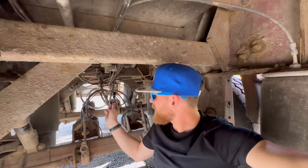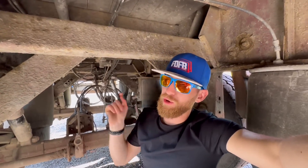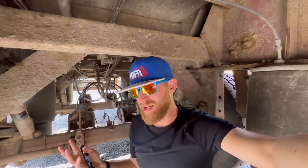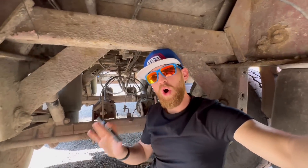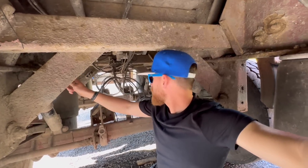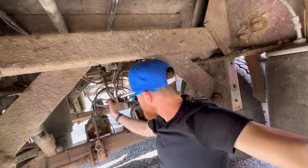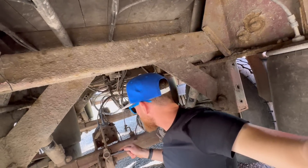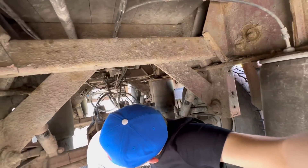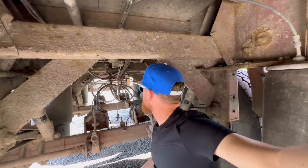The whole axle flipped up and caused a load of damage in the process. This airbag went, and a back airbag — the whole trailer collapsed at the side of the road. I managed to get the load off and basically make two axles out of three broken axles at the side of the road. On the second axle, both springs obviously replaced, both shock absorbers, both saddles, both chambers. No new slack adjusters — these are fine. S-cam bushes done. Drums are fine on this one but it did have new shoes, so it's been re-lined, and obviously new airbags.